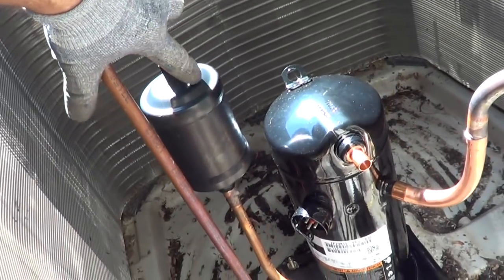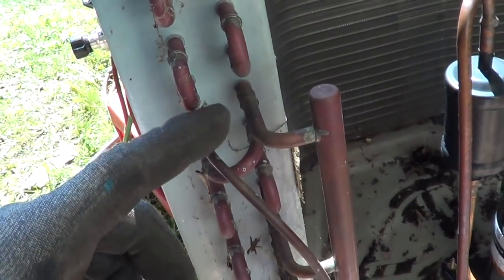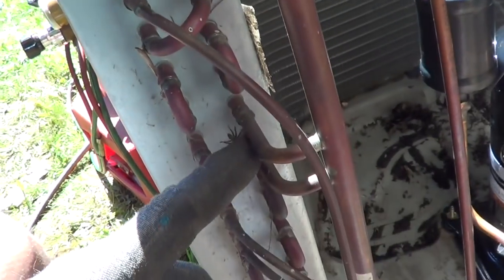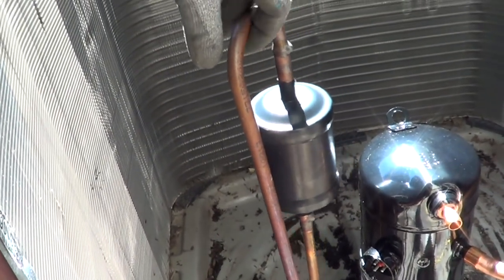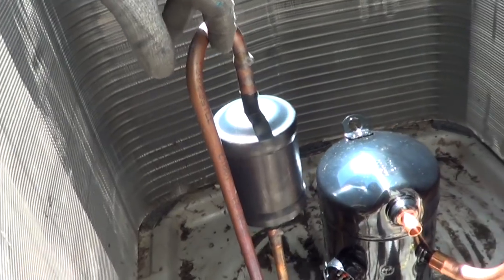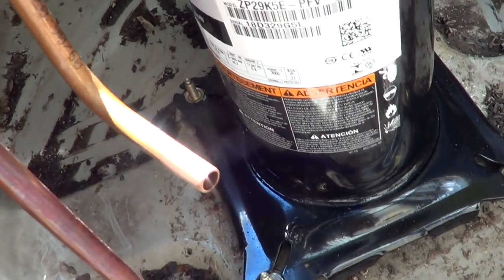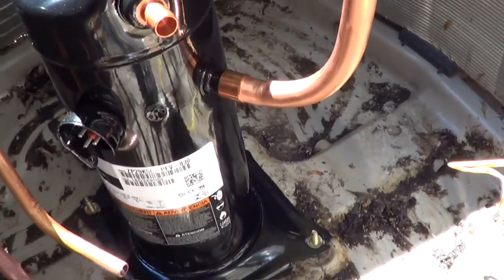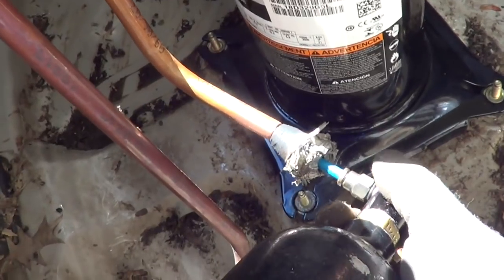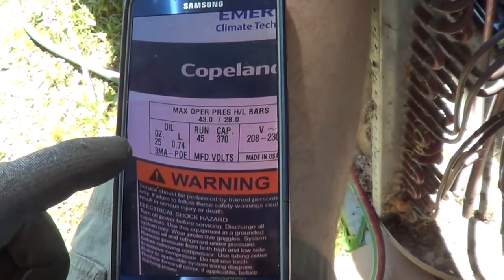This muffler on the discharge line is really important — it stays. We have 4 or 5 millimeter skinny tubes and you don't want vibration on these. I'm going to check that when it's running. I sanded the pipe but you inevitably get aluminum oxide sand dust inside the pipe, so a quick easy way: use some CO2 to blast it out, just like that.